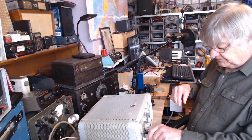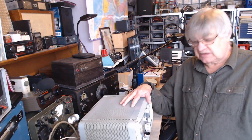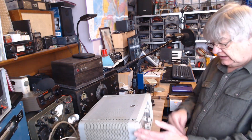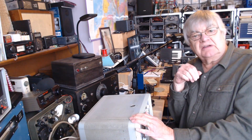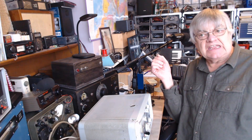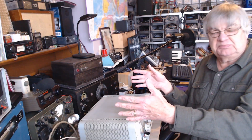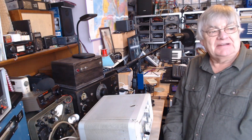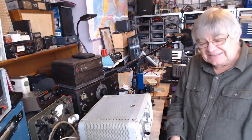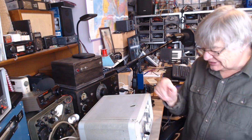That's going nicely. Let's turn that off. I've downloaded the manual and had a look, and it seems to be 1966 — I thought this was 70s, but 1966, stone the crows. Single sideband, because it was all AM originally — single sideband in 66. Do you remember the Heathkit SSB adapter? You get an AM transmitter, you've got this huge Heathkit SSB adapter, you stick the RF out of your transmitter into this adapter and it would suppress the carrier and whichever sideband. Fred Erbein had one and it worked, though you did get some carrier going through.